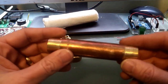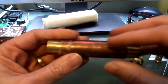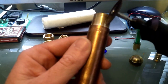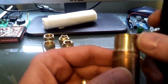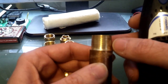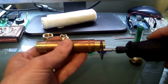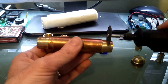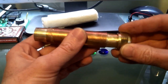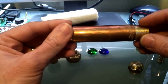It starts with buying a 3-inch brass nipple. This one's red brass — it doesn't really matter because I kind of file or sand it all off, so you're going to lose the coating anyway. I've already belt sanded the threads down. You can kind of see the stripes here where the threads used to be. And then once that's belt sanded down, I take my Dremel cutoff wheel and cut that thread area in half on both sides. That's what makes the collar that'll hold the nut on eventually.